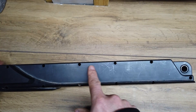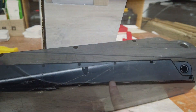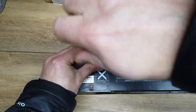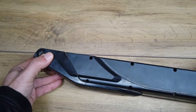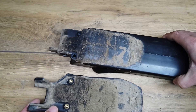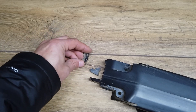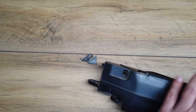First thing to do is remove all the little rubber plugs that come in the side here. There's a row across the bottom and another row across the top, and then we're going to remove these two large hex bolts. That should give us the ability to remove this fascia plate here. Wow, look at all the mud in there — someone's been using this on the mountain trails. After taking it apart and giving it a little bit of a cleanup, you'll notice that one of the support structs has broken, but that's not an insurmountable problem.